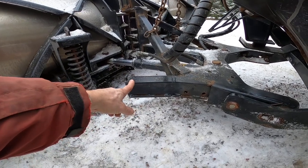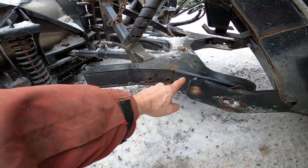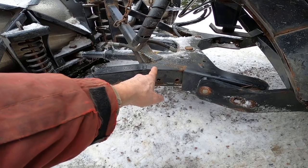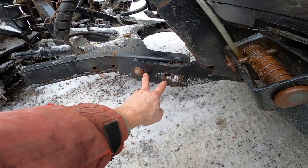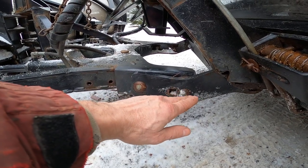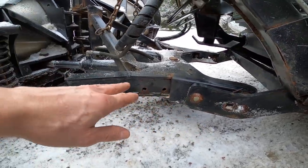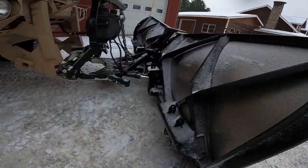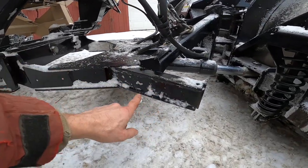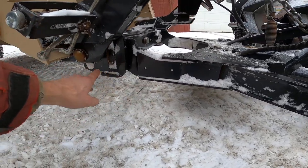On the nine-and-a-half, the blade stops were a bolt-on option, and mine actually broke right out and fell off, so mine are now welded on. Also on the nine-and-a-half, you could adjust the height of the T-frame for different vehicle heights. On the ten-and-a-half, that is now welded in as one piece — the blade stops come welded in standard, and there's no height adjustment, just the three holes in the back like before.